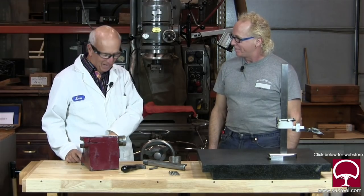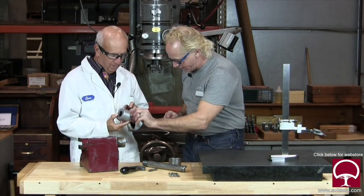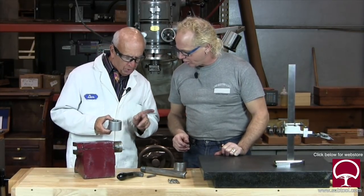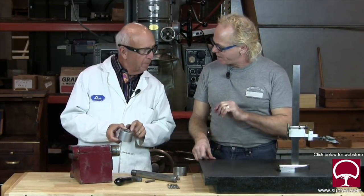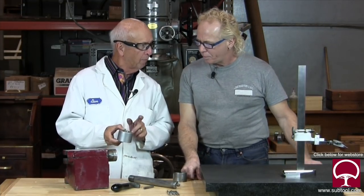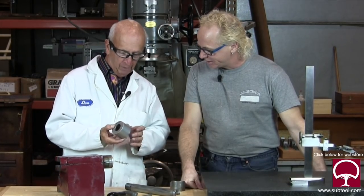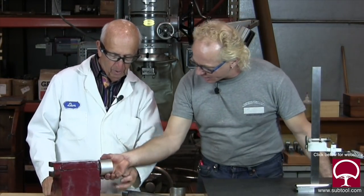Glenn, we did it. Got the part — want to see it? It's pretty cool. Wow, nice and shiny. It's actually a little bit thicker on the inside too. That looks nice. What are the holes for? Good question — you know how this was getting worn from the wheel hitting it? We're going to put some carbide inserts in there. The carbide is very hard, so if the wheel hits it, it's not going to grind apart — the carbide will prevent it from being ground. Is that something you thought of? Yeah, this guy's a genius. And then we hard chromed this, which we didn't have to do, but we had the hard chrome. And then that part ends up fitting over here like so. That's the idea of it — is that cool?